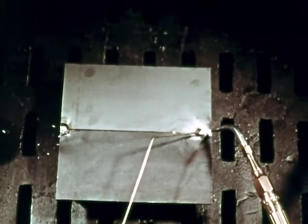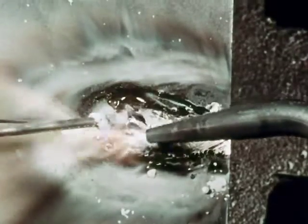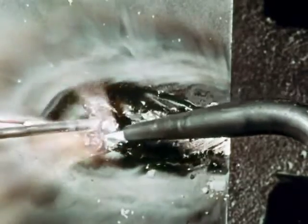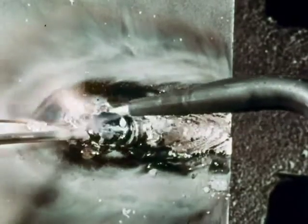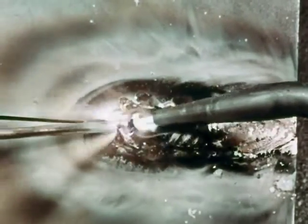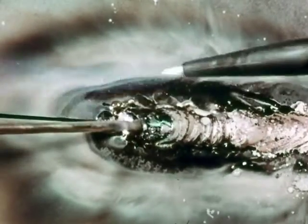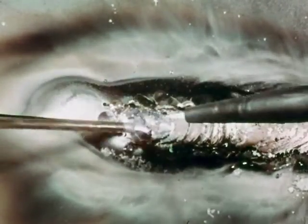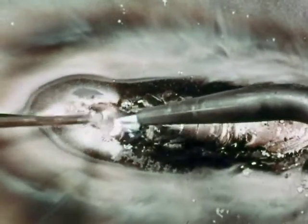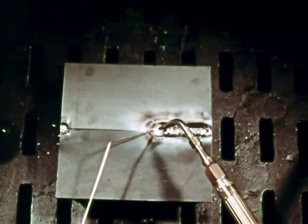Now go back to the right end. Play the flame in small circles over a spot the size of a quarter. Melt the surface of the tack weld and the rod, and begin moving the puddle to the left. The rear of the puddle will harden as you move along. Everyone finds in the beginning that the hot end of the rod will stick now and then if it is too close to the edge of the puddle. Don't try to yank it loose — just turn the flame on it and melt it free. When all the flux on the rod is gone, dip the rod into the flux again.